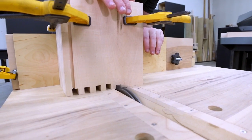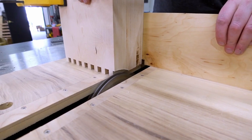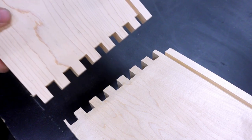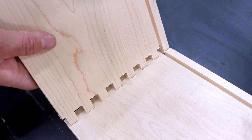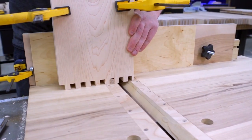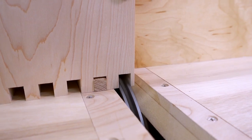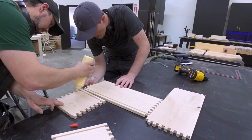We use box joints instead of dovetails because it's different, and any method will work just fine. Box joints can be a little fiddly though, so if your fit is too tight, a great trick is to throw it back on the jig and cut the last 3 grooves one more time. You'd think this wouldn't work, but it actually does, at least with my setup.